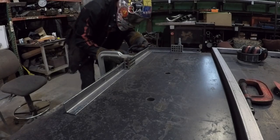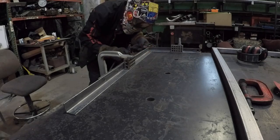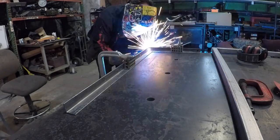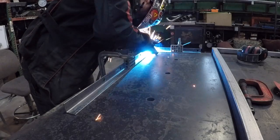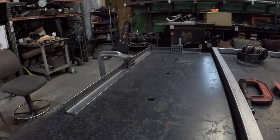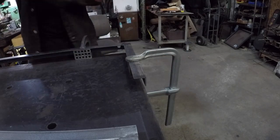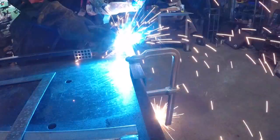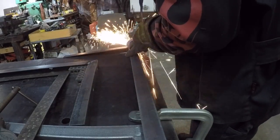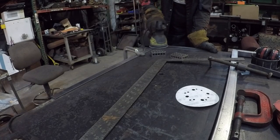Over here we've got a simple miter on the angle iron, clamped down with 1-2-3 clamps so the clamp isn't sitting on the material — it's held pretty flat. Using a spot technique on the edge so I'll build up a good edge that when I sand it down I can get a nice crisp corner as opposed to a really rounded one. Once again using those 1-2-3 clamps — dig a bevel, fill it up, grind it back down, and sand it.